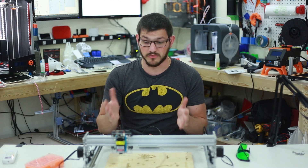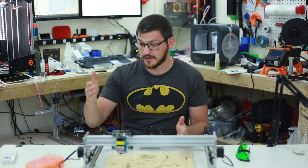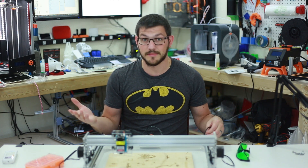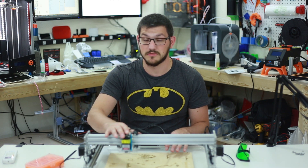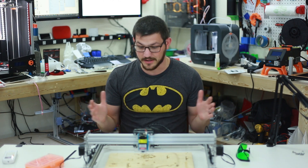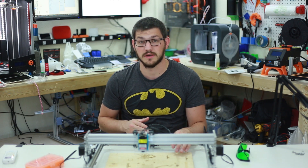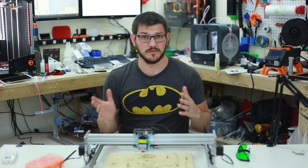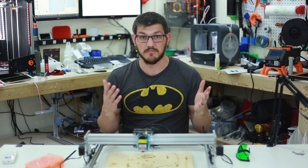The build quality is great. You really can't beat it for $200 if you're looking for something to learn on. If you have aluminum extrusion, a 3D printer, extra steppers, pulleys, and GT2 timing belt, you could do this for a lot less than $200 — because the laser alone for the 2,500 milliwatt is $65, and that's your biggest cost. The board is cheap, using an Arduino Nano — like $2. So you could do this a lot cheaper if you have spare parts, but otherwise it seems a good place to start and learn how to use the software.